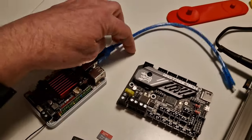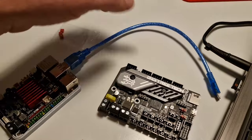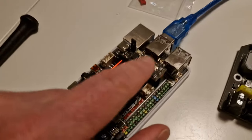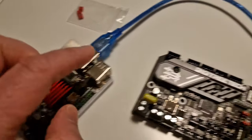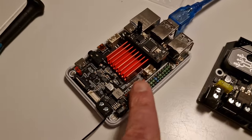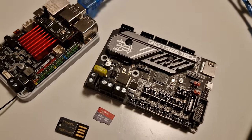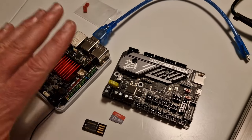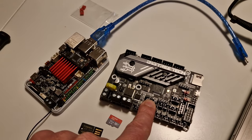Other things you're going to need: a USB cable. I'm going to be showing you how to install it with a USB connection — this is the basic setup. There are other ways: you can use a CAN bus adapter, or UART, which is another way of connecting through the GPIO pins. But we're doing it the easy route. You need some sort of Linux computer — Raspberry Pi, BigTreeTech Pi — and your microcontroller, of course.